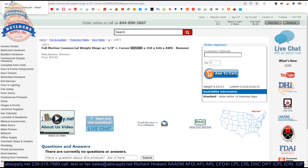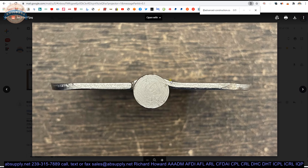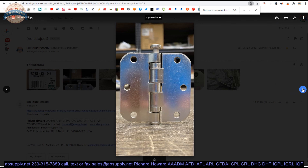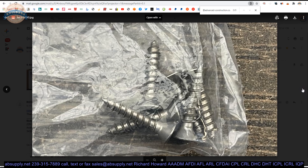Now on screen: here's the hinge we're looking at. There's the box, and here's the hinge showing the swag on the hinge leaves — this feature makes it a full-mortise hinge. The backside, the logo, and a close-up show they do a good job cleaning up the crotch area between the barrel and the hinge leaf. The fasteners included — my part number includes the letters AWS, telling the factory we want all wood screws, since this is not a hollow metal frame application.